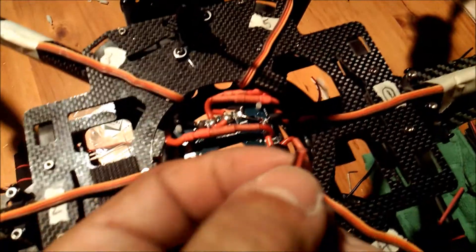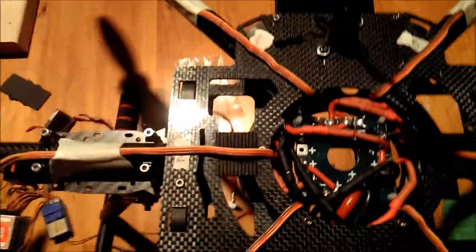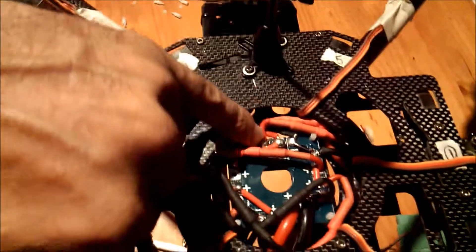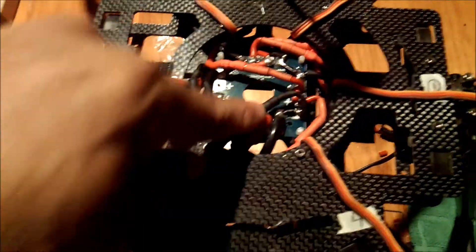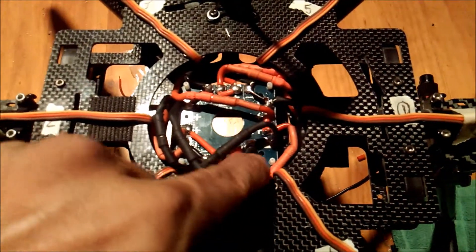If you've got little wire, trim the wires down. Let me show you here — on the bottom end of any wire, the braided lines coming out, you've got to make sure you trim them properly between anywhere where there's a possible connection between the positive and negative. Any little tiny wire strand that's touching — that's bad news. So make sure you triple check, quadruple check continuity from the main lead to all of your positives, and then from the main lead to all of your negatives.